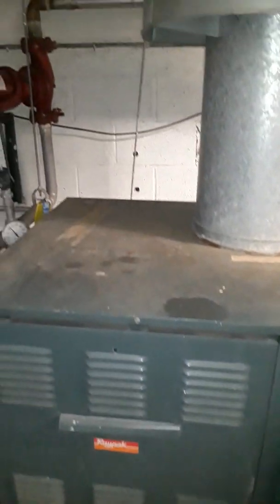This one we're going to replace with a KBN 401. We'll take the vent — I've already checked that out. We can take the vent out through this mechanical room, through that block wall, above this hallway door, above the ceiling. On the other side of this door there's access. We'll have to break into a chimney that's been abandoned, but it is open — I just checked it. So we can get the four-inch PVC pipe up out of it.